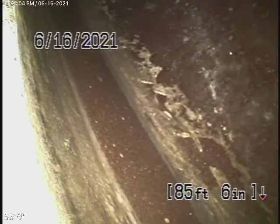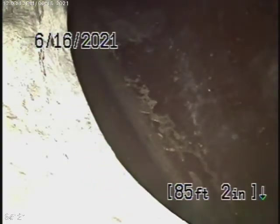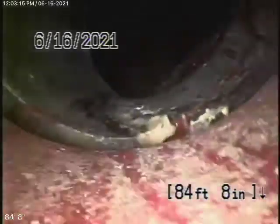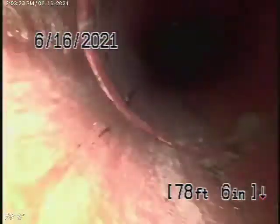We're all the way out to the city connection, which goes to the alley in the back. Right now we're at the city connection — there's the city sewer right there. There's a little tiny root coming in right at the end of the line, and then we have a six-inch clay pipe coming back from the middle of the alley towards the property.